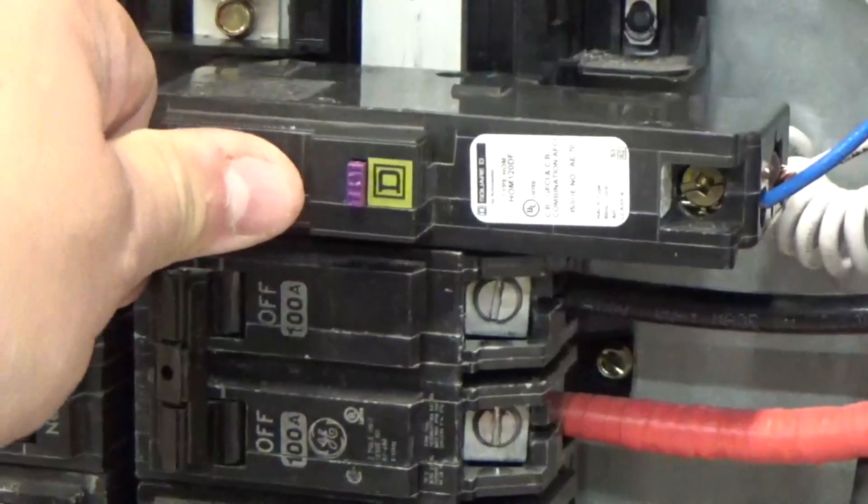Now that we're all wired up, turn the breaker on. I hope this video helped show you how to install a GFCI breaker in your panel. It's very simple. Make sure the circuit you're using and the neutral going to the outlet or circuit lands on the breaker — as long as it lands on the breaker, you're good. If this video helped, give me a thumbs up. If you haven't subscribed and this is your first time to the channel, thanks for being here. Hit that subscribe button and the bell so you can be up to date with the newest videos — I put videos out every Friday. Have a great day and be safe.